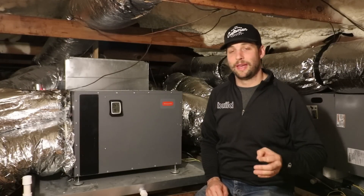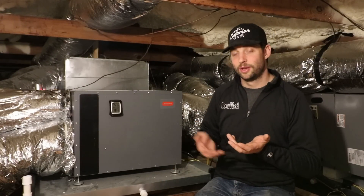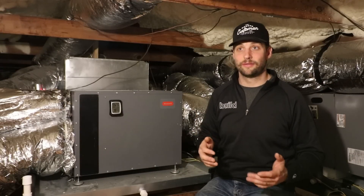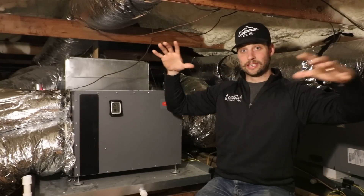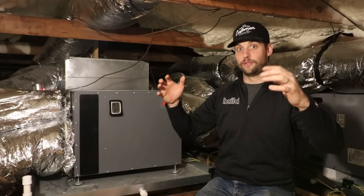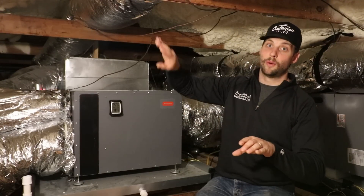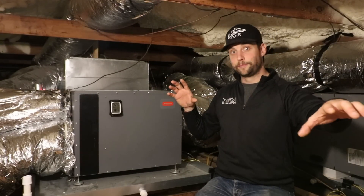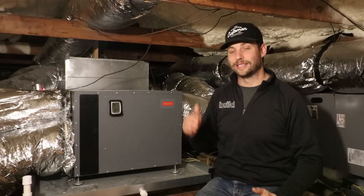Something about humid air that doesn't quite make common sense is that humid air is less dense than dry air, so humid air floats on top of dry air. Up here in the attic, you're always running a few percentage points higher humidity than downstairs. In this house we have a conditioned attic — spray foam all the way up against the roof — and this whole area is conditioned. If you didn't give consideration to humidity up here or allow air to circulate between the downstairs conditioned space and this upstairs space, you might have problems with humidity rising uncontrolled. We have openings that allow air to circulate, so we're running about three to four percentage points higher up here than downstairs.